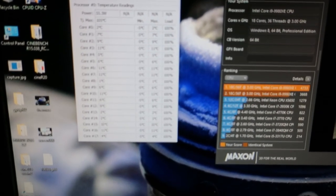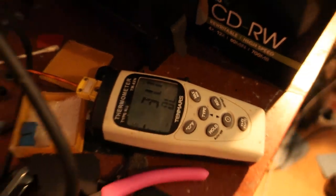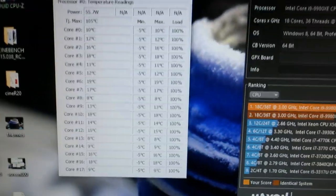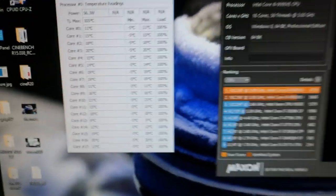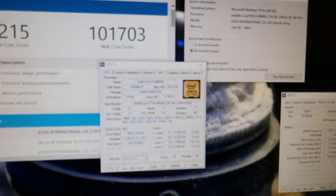The CPU temperature must hit like plus 20 to 30. Now I'm doing minus 30 on the pot, so when it's like minus 20, that's enough. So now the cores are already like plus 15, plus 20, so I will stop the heat gun now. Just let this pass, then I will shut down and I will tighten the thumb nuts with the pliers.